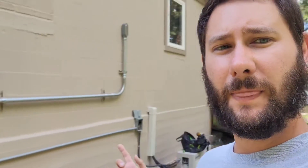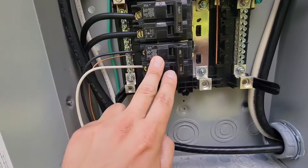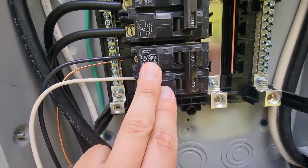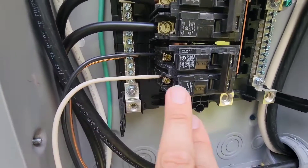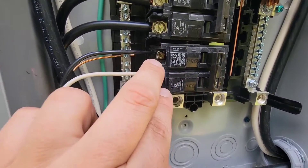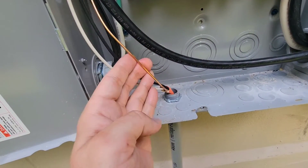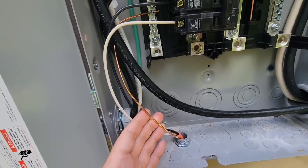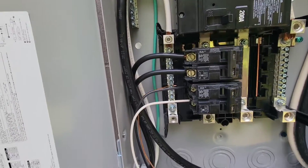Let's go ahead and talk about how you wire up this disconnect — this 230 volt disconnect — and the breaker, and then wire up that mini split. Here is the breaker that powers the 230 volt unit. It's a 230 volt double pole breaker and we've got two hots. We've got our black and our white wire going to this breaker and that gives us 230 volts. And then we've got a ground wire right here, although it's not really supposed to be hooked up right here — it's supposed to be hooked up over here where the ground is.